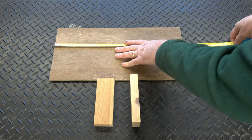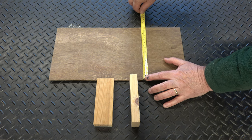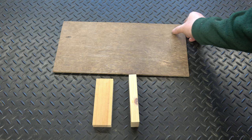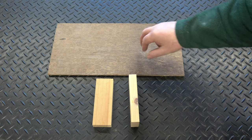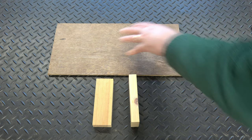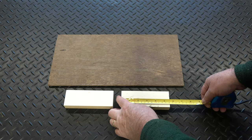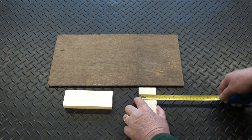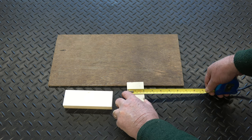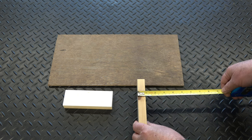It's 16 and a half inches long — these measurements are not important — and it's eight inches wide. Quarter-inch ply, three-eighths would be okay, MDF, anything like that. It just has to be big enough to make the table out of. These two pieces have just been reclaimed from an old drawer — five and a half inches long, cut down into two-inch widths, so five and a half by two inches and seven-eighths of an inch.